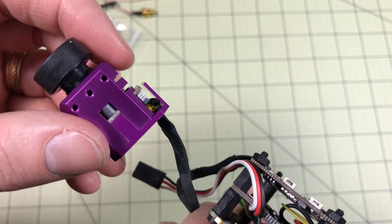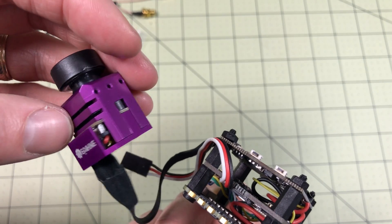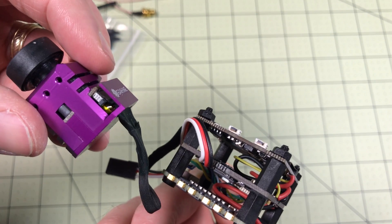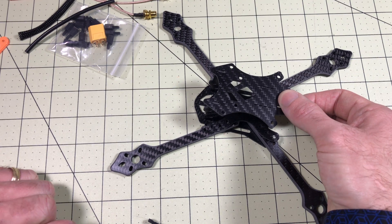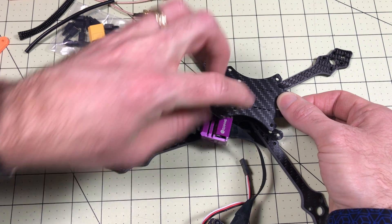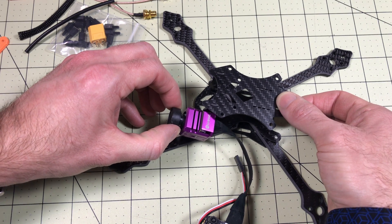Then there's the camera, which is honestly the biggest concern I have. This camera is really, really long and I found already that that's a problem. There are three mounting holes, which is convenient, but they're all the way at the front. I'd rather have a set in the front and the back, because this is making it so I can't mount it in the frame I had in mind. This camera is the same width as what you'll have in a RunCam Split — it's 22 millimeters wide. So I went and looked up some RunCam Split printable adapters and found one. This is the frame I picked for it initially — a RealACC 210 stretch frame — but once I looked at where the screw connectors are for the camera, the mount goes right where the stack goes, so the camera would end up in the same position as the stack, which obviously isn't going to work.